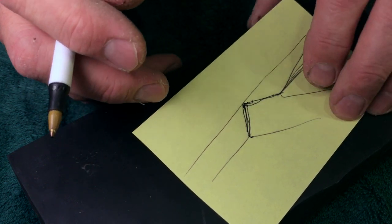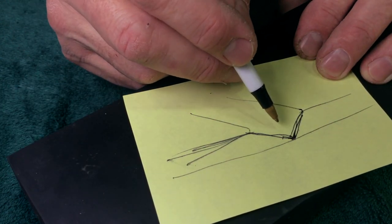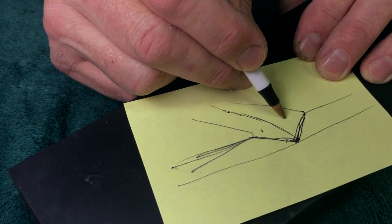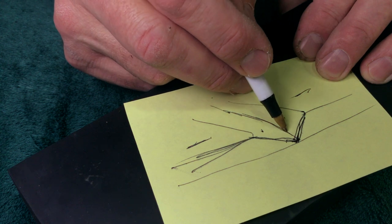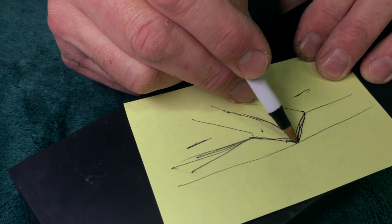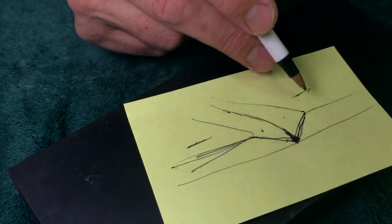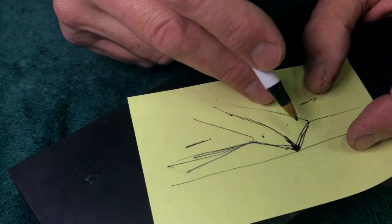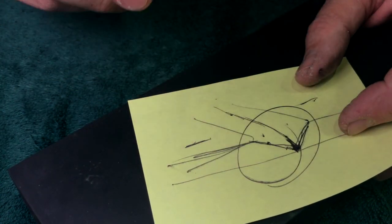When you're polishing, I'm really sorry, I'm not a good artist. But when you're polishing, if I draw this, this is a surface and this is a surface. This is a surface, this is a surface. When you're polishing, you're working on all of these surfaces. This line at the bottom is technically a surface also. And when you're polishing this, you're breaking through. And then when you have the crossover striation that we saw in here, which I am unable to draw and have it not look like a log jam that threw up, I think you can kind of get in your mind's eye the picture I'm trying to draw. You create mayhem. You wind up with problems here.